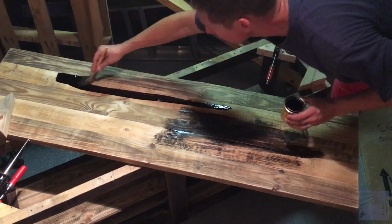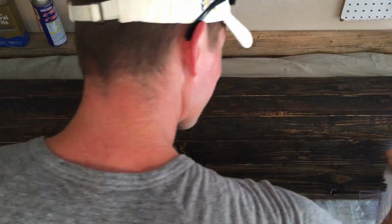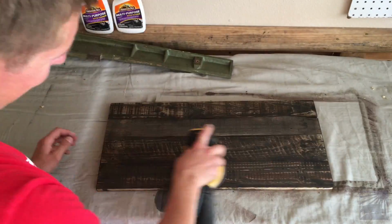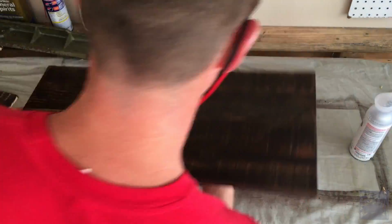With the shelf panels and tabletop glued up, I applied a coat of stain to each. The stain started off a bit dark, especially the shelf panels, as they were particularly porous and rough. So after a coat of clear spray paint, I sanded the surfaces down and then reapplied another layer of clear.